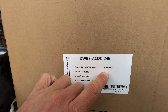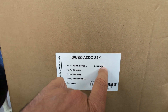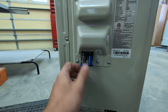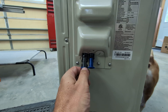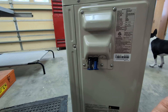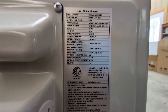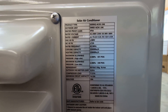Then there's the DC input — this is where you can plug the MC4 connectors in, which accepts 90 through 380 volts DC. On the side of this unit, this is where you would put the electric into it — just standard MC4 connectors, so you can clip in your solar array. No intermediary is needed. You don't need an inverter, you don't need a charge controller. Just plug your solar in. I'll zoom in so you can see all of the specs on the side of the unit.